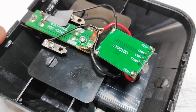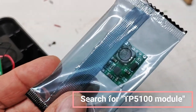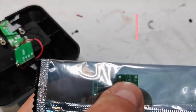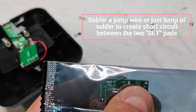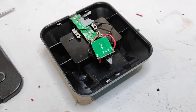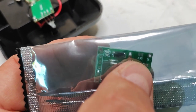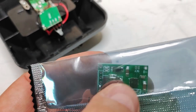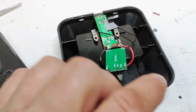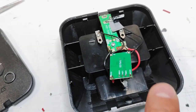This is a circuit board I bought from AliExpress which can be used for charging lithium batteries with one or two cells. You have to solder a jumper here to configure it for two cells. Remember, the Baofeng has a two-cell battery, so without the jumper it defaults to 3.7 volts, but you need 7.4 volts for a two-cell battery.